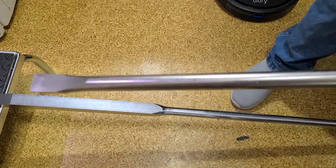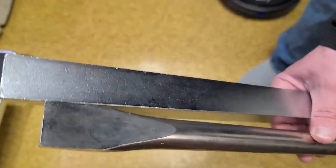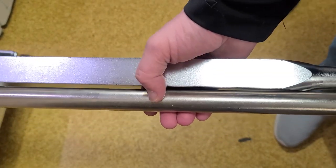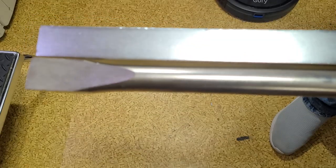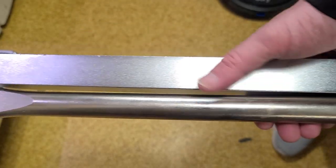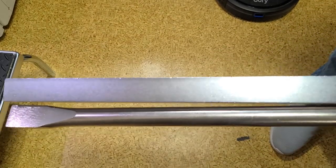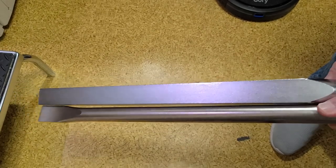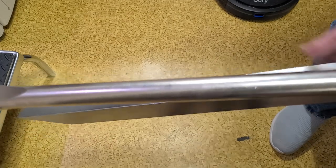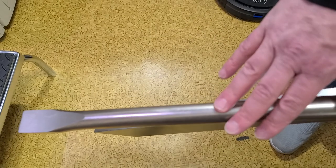And so the big deal about these, both of these bars here are Gray 60-inch bars, but the reason they're known as a rock bar is just the fact that versus this 1-inch diameter, which I know is more of a traditional pry bar or pinch bar, these big square ends, you just get 16 inches of 1 1/4-inch square material. So when you're using any pry bar, but particularly big ones, it's right here, right in the area near the actual toe that ends up bending.